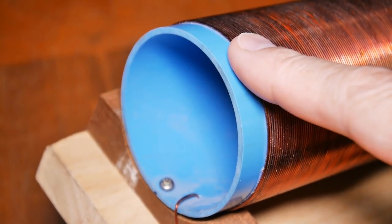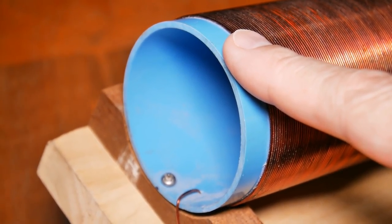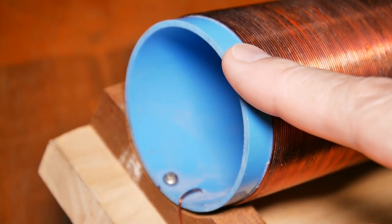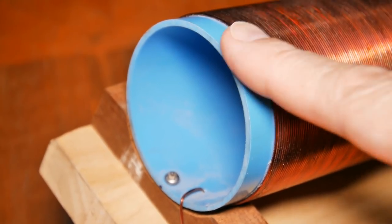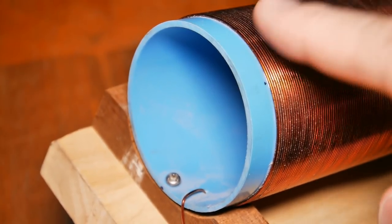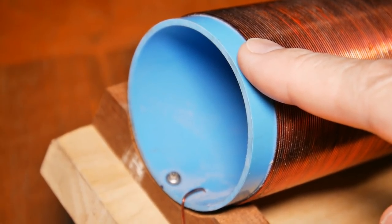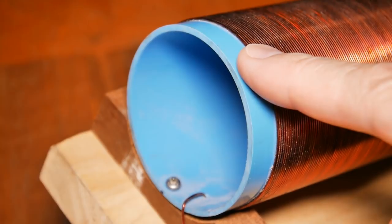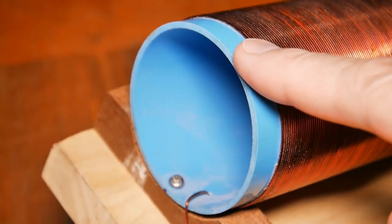Another thing which will cause problems, it probably will not keep your radio from working at all, but it will probably keep it from working very well, is if you use a tube that is not the specification that was given by the builder. So in my videos, I have the specifications listed in the description, and you must use the same diameter of tube as the specification, otherwise you'll be off on another frequency, and if you're too far off, you won't get anything. You'll likely be off in a band that's not AM. Okay, so tube size is important.